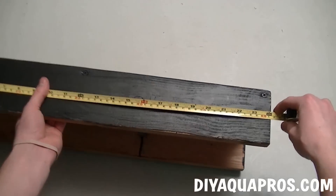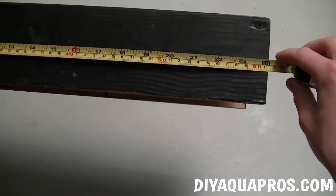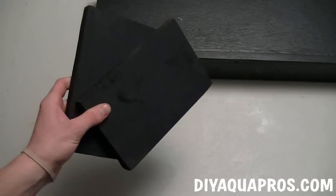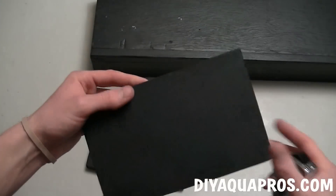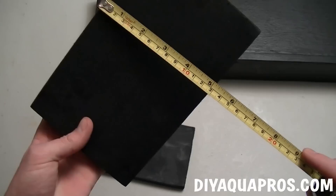The length of the entire housing is 24 inches long, the length of our tank and of our bulbs. These three individual pieces are held together by a few 2-inch wood screws. The last part of the housing are these two side pieces that we'll screw on at the very end. They'll serve to hold the fixture in place over the aquarium, and their dimensions are 8 by 5 inches for this particular project.